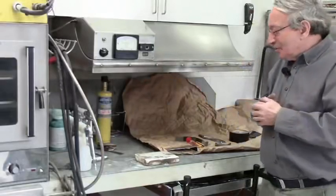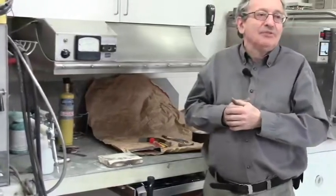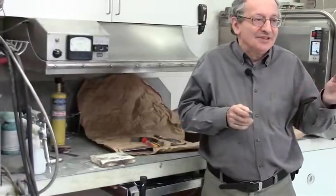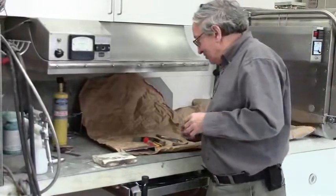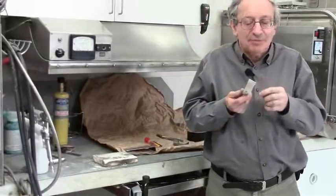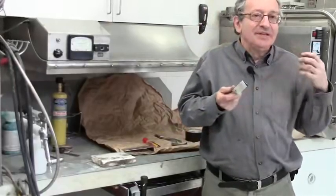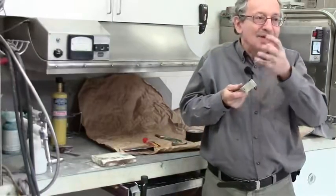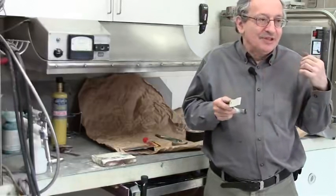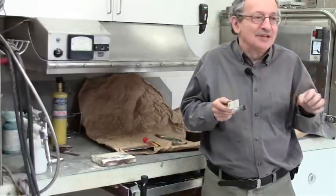The big advantage of heating up an object before painting is that anything which can give you bubbles or defects in paint will disappear in the first round of heating. Let's say I have a piece which is welded and drilled and there is some moisture trapped or some cutting oil trapped in it. If I powder coat it, bake it, this cutting oil will bubble out and make defects in the paint. But if I heated it up anyway once before painting, everything which is volatile came out already, so the paint job is more likely to be perfect.